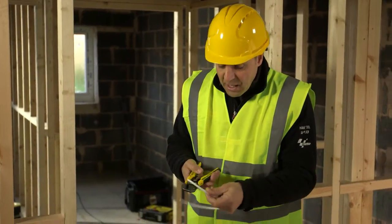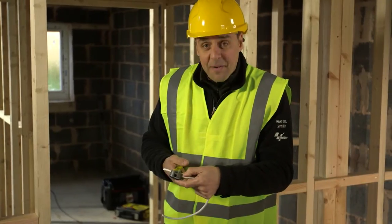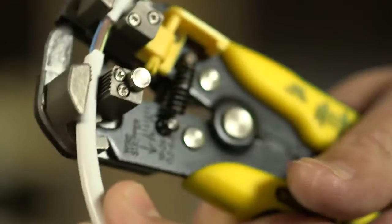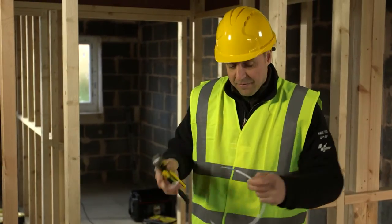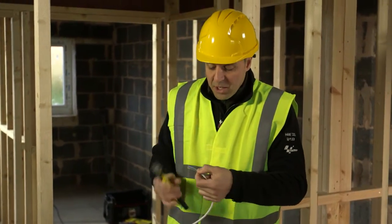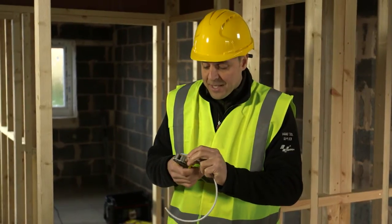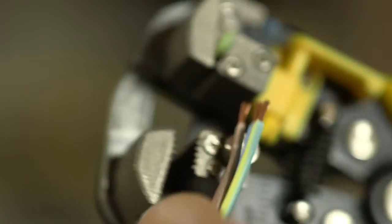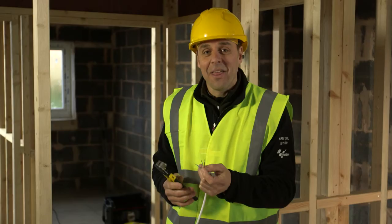In the business end of it, you literally just put your cable — whether it's flat or a round PVC cable — into the stripper like so, pull it back and you've taken off the outer insulation. Once you've got the inner cords, just make sure that they're flat as they enter the jaws over the anvil, pull it back, and the cable's stripped. It's really that easy.